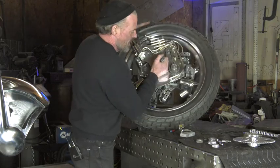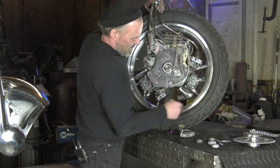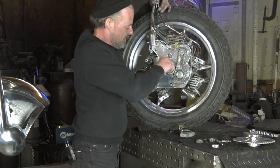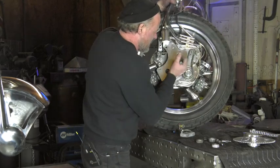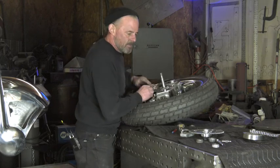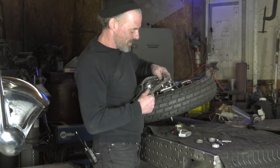Now I have my spacer in there. This will spin on there — I've got tubes holding everything so nothing can interfere with the wheel at that point. Then we'll put our first bearing on there — goes in there. Then shims for the clutch, and then the final drive sprocket. Look, it's got three groups of three holes in it.